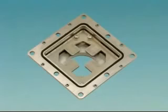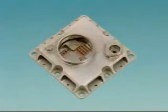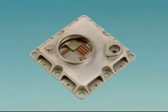Another key technology of SV2 is spray evaporative cooling. Our processor chip, because of the custom blocks, has approximately 45 watts per centimeter squared heat flux density. For a point of reference, that's approximately the same heat flux density that you have on the space shuttle reentry on the tiles.